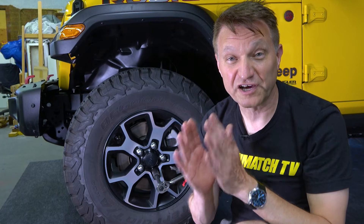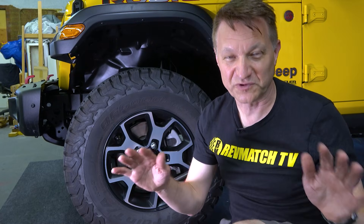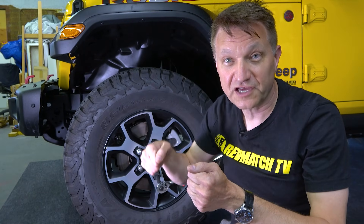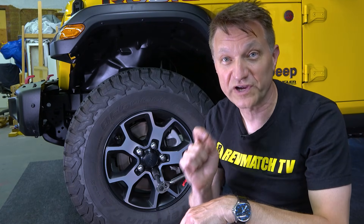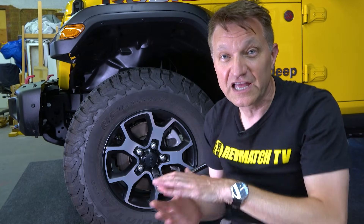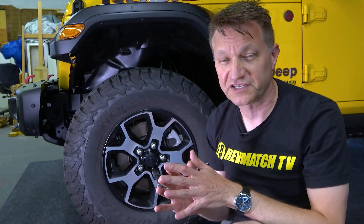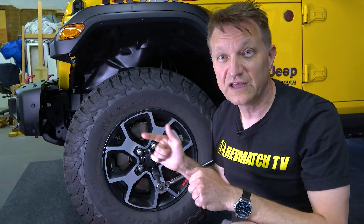Here's the part there's a lot of confusion about — I'm going to clarify the right way to do it. I don't care what your grandfather or uncle said: it's one click. Here's why — as you're pushing through, when you hit that torque value the first click lets you know you hit the right value. When you release and take pressure off, you're going to hear a second click, and that is a little cam inside clicking onto the next notch. So the second click is the release — you only go to the first click when you're pushing through.